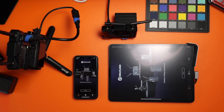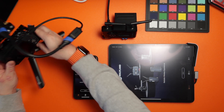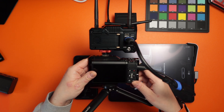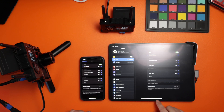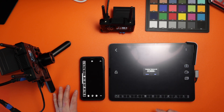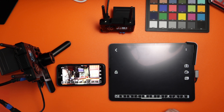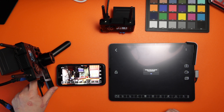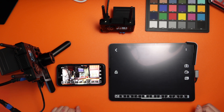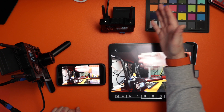Now let's take a look at the Hollyland app — it's called HollyView in the app store, and it works on Android as well. With the 400s Pro it enables you to send to the receiver as normal and record into a capture card, but at the same time you can run a number of smart devices. You connect to the Wi-Fi of the Hollyland receiver, go into the app, put in the serial number, click join, and you'll see both screens pop up along with the latency between the two.